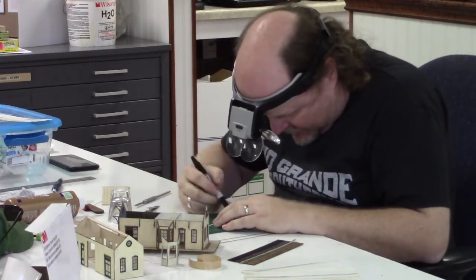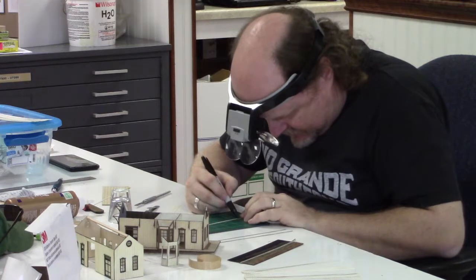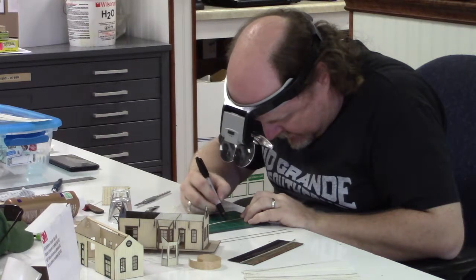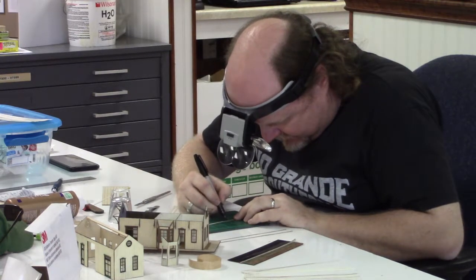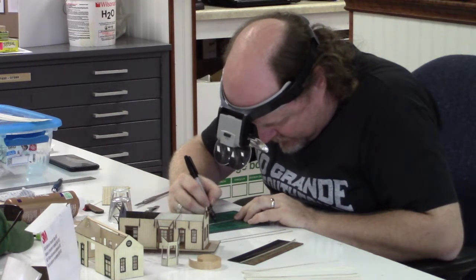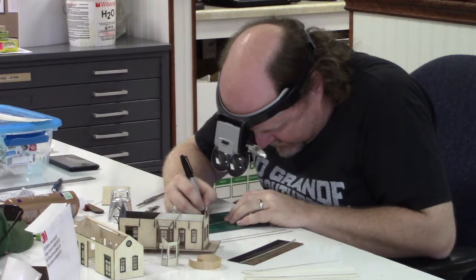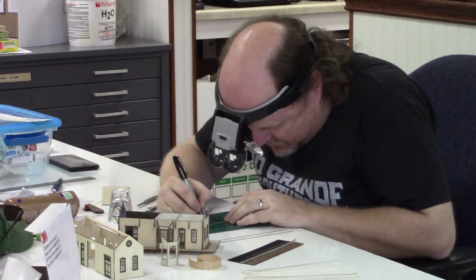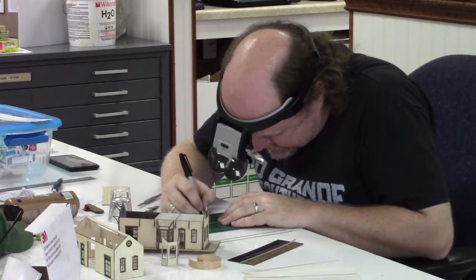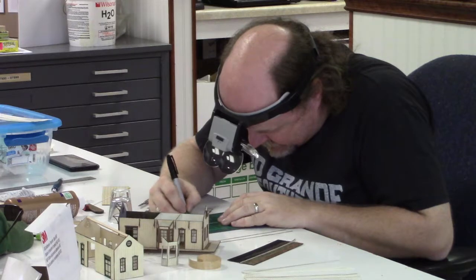They've got them now too, what they call an architectural grade, where they've made them thicker. They've got some asymmetric tabs to them, and they're really, really good. If you get talking to a roofer about your roof after a good hailstorm, there's a couple of options. The really expensive one is using the shingles I'm talking about. They last forever. They're a little more hail resistant than the other, because they're thicker, and it gives you more of that asymmetrical shake shingle type of look. And they get a longer warranty, too. Yes, they do, by a lot. You go from a 5-year to a 10-year or sometimes 15-year.